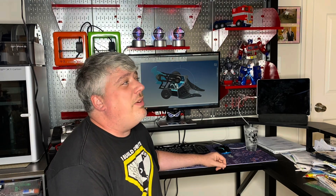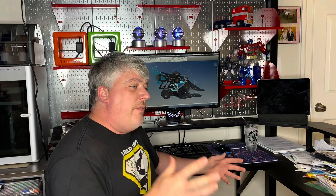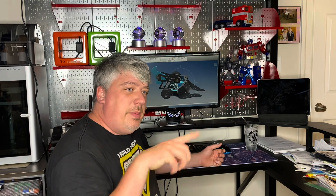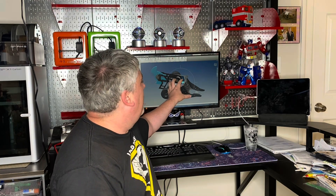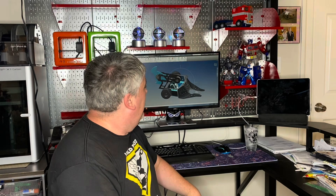What 9.5 is: we're basically taking all the weapon upgrades we wanted to do on Scorpios 10 and making a new custom hat that'll fit onto the old frame. We're going to bring our old trusty drive and the wedges everybody knows and loves, but we're going to try a whole new weapon assembly. Originally all the weapon motors were mounted in the base, and the hat sat on top with a pulley and gear to transfer power up. This time we're mounting everything to the hat — the motors and gearboxes that move the arm, and the motor that spins the blade. So as the robot takes hits and gets deformed, the weapon modules will go with the hat and hopefully stay running longer.